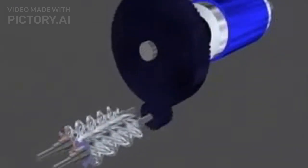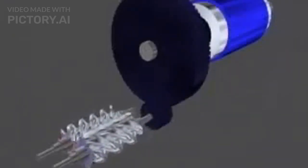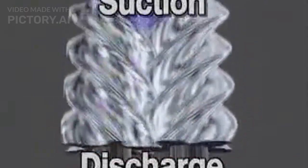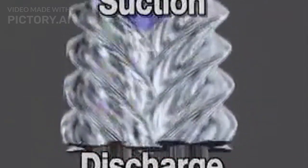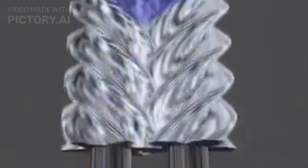The design pictured here has four lobes on the male rotor and six on the female. Therefore, the male rotor rotates more rapidly than the female. This visual shows the movement of the refrigerant vapor from the suction to the discharge of a screw compressor, as viewed from the top. The vapor enters the suction area of the compressor and is trapped between the two lobes of the rotors and the compressor cylinder wall.